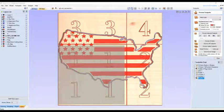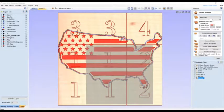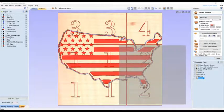And then you need to slide your workpiece to the left, exactly your 16 inches. So it really helps to have some kind of indexing system like guide pins or stops. And then you mill out your tile section 2 completely. And like I said, it's really important to get the full 16 exact inches shifted.